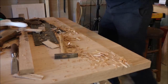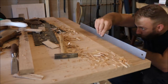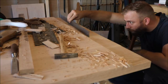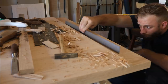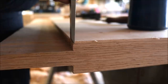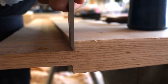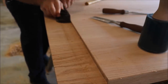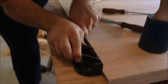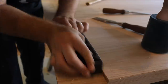The reason I use a shoulder plane and a router plane first is because a regular bench plane's blade doesn't extend the full width of the plane sole, and so I would never be able to get down to depth right next to the shoulder. Earlier when I was cutting to depth with my crosscut saw, I left myself about thirty-seconds of an inch just in case. So I'll take a shoulder plane and sneak up on that line just until the knife line disappears. I used a chisel at the very end so that the shoulder plane didn't blow out the fibers.